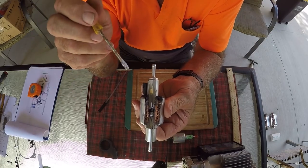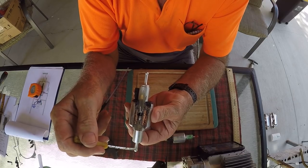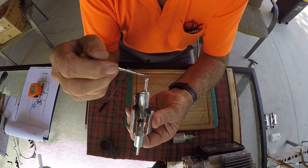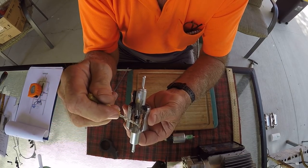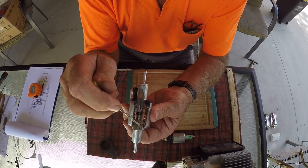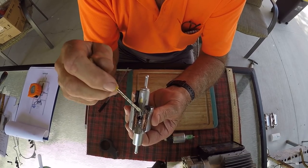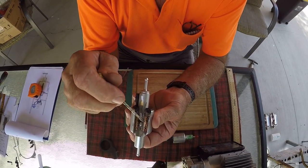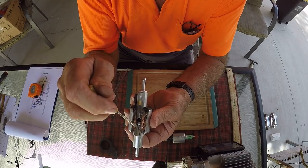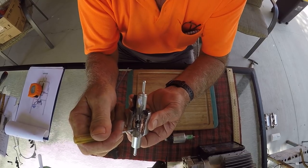Okay, I've sliced this little dosing pump open. So the diesel comes in here and at the top here. Now here you can see the copper windings for the electromagnet. So when current is put onto here, and it takes about 2.5 amps to energize this, this energizer becomes magnetic and the little piston here flies up, boom, and then comes back.